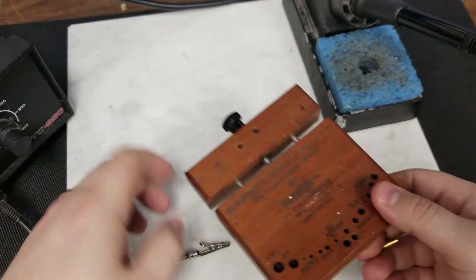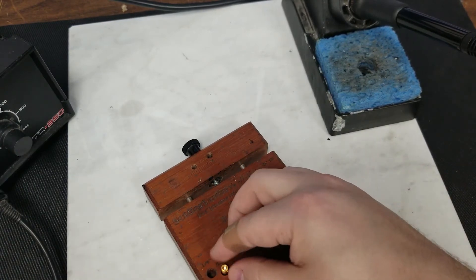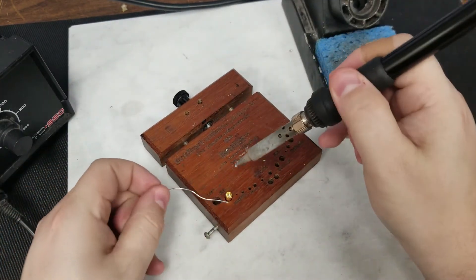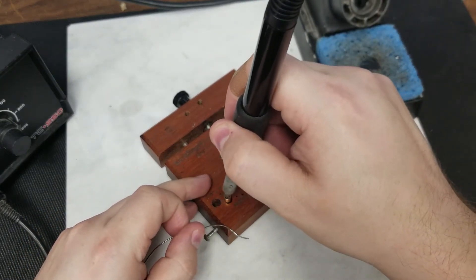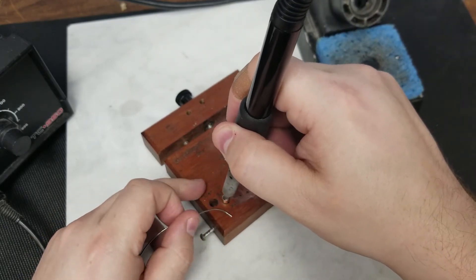Pay close attention under the wire to make sure the solder liquefies, and as soon as it does, remove your heat and hold the wire still — if you move it around too much you'll end up with a cold solder joint. Looking at our connector, we have that nice shiny finish and a completely covered connection, so this is a successful connection. When soldering a bullet plug, we use the same tinning method, but we only tin the inside of the connector about half full — overfilling will result in an overflowing solder connection.